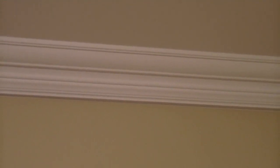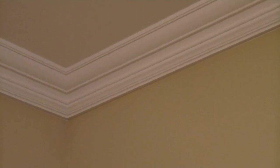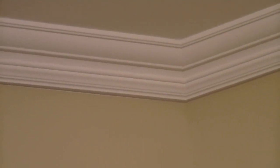You can see there's no creeping of the paint under where the tape was, and no paint has been removed, so we got a break. Elsewhere in this particular project, the paint did come off the wall a little bit with the tape. So what we have to do is hopefully find some paint that matches in the basement, or in this case it was in the utility room, and just sand the hard edge of the paint where it comes off, and then just touch it up. Because it's flat builder's paint, it's very forgiving and it doesn't show up. It's probably the only finish where you could do that without having to spackle to make it all smooth. And then you'd probably have to repaint the whole section of the wall where it peeled.